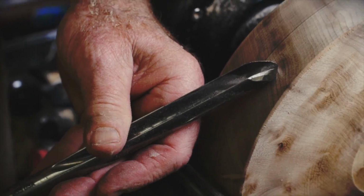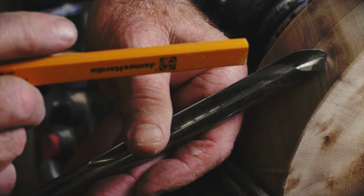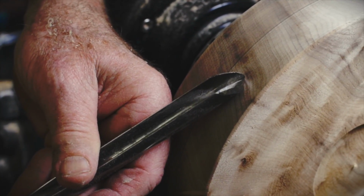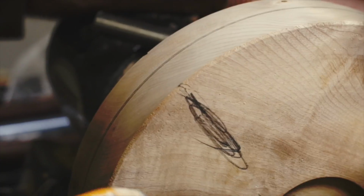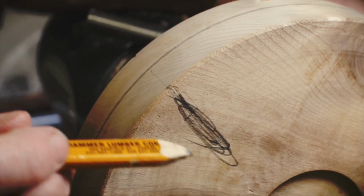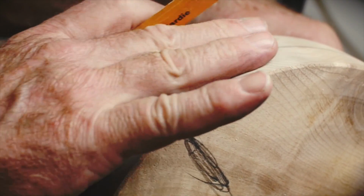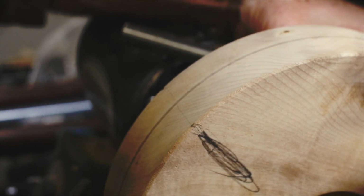They both work. If there is any difference between a gouge and a scraper for shear scraping, the only thing that I think could make any difference is this angle between the wing and the flutes is much more acute than the angles on the scraper. But again, I really can't tell any difference on the finished surfaces, so six of one, half a dozen of the other to me. So this was my nastiest spot for the tear out. This side was done with a gouge, this side was done with a shear scraper. Maybe a very slight color difference up here for tear out, but the surfaces feel pretty much identical. Not a whole lot of difference between them. And that's pretty much it for shear scraping.